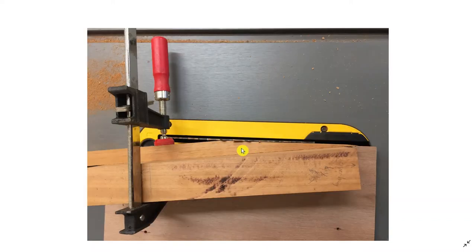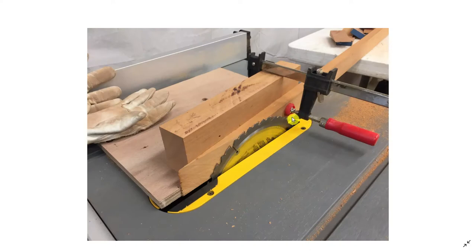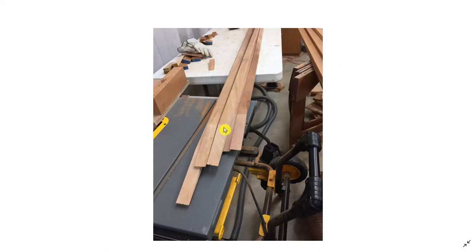This top view shows what the setup looks like. One thing to watch out for is not pushing too far or you'll hit the clamp with the saw blade. You cut nice and slowly, and it works really well. I have a table that's roughly the same height as the table saw, and you just slide the whole board at an angle, and it cuts a really nice scarf joint. Here are the pieces after the scarf joints have been cut.